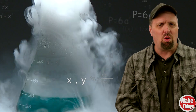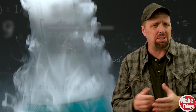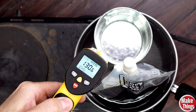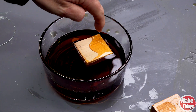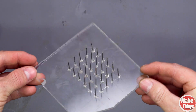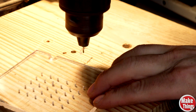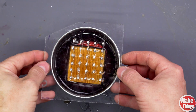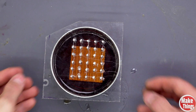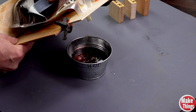Let's get into the test. Will heated oil actually penetrate deeper, or will it seal off the surface faster like some experts claim? There's only one way to find out. My water bath is sitting at 130°F, which has brought both the oil and the test container up to the same temperature. Since oil causes things to float, during the warming period I built a plunge device out of acrylic and nails to hold the test pieces under the surface. I used a drill press to make a grid of holes, slid in the nails, and added a dab of hot glue on top to hold it all together. It also helps trap the heat inside while we dunk each block for exactly 10 minutes. I'll be using fresh oil for each round — both warm and cold — to avoid any cross-contamination.